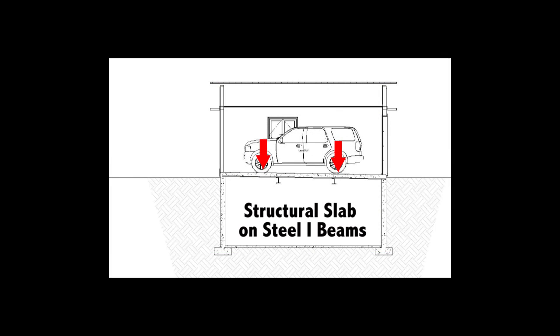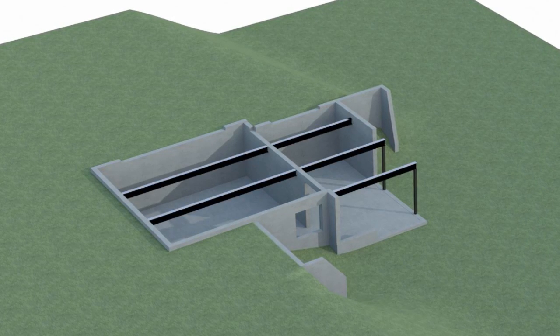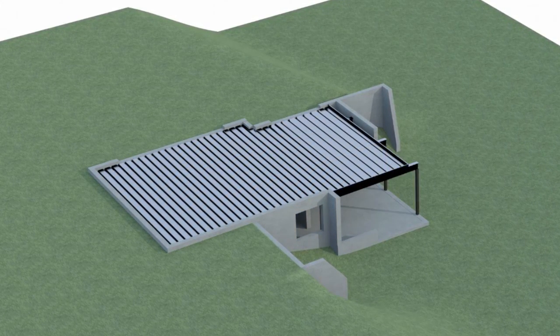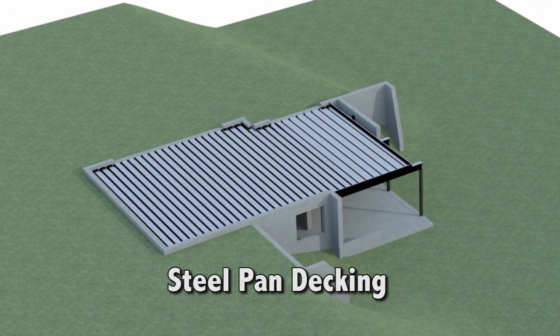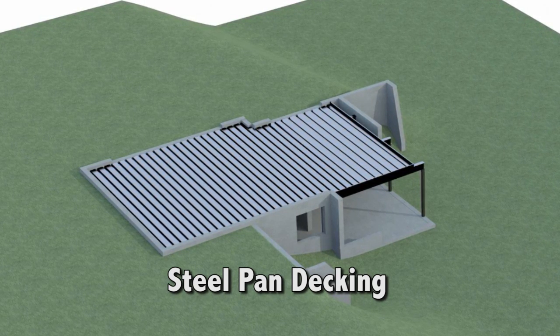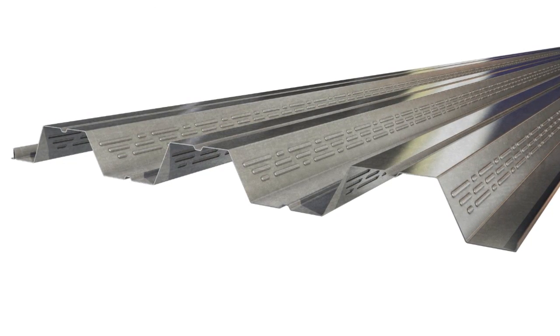I did my research and decided on pouring a slab over a combination of engineered structural I-beams and steel pan decking. These interlocking steel pans are a permanent form that we pour the slab on. The ribbed profile of these steel pans interlock with the concrete and provide an additional level of positive reinforcement.